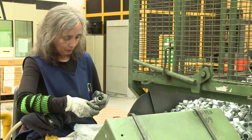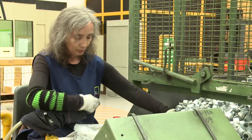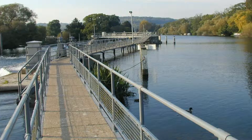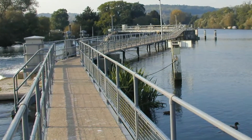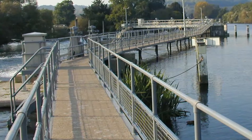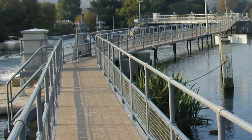This means that the average life of a structure using corrosion-resistant hot-dip galvanized Key Clamp fittings will be 37 years in a category three town such as Newcastle upon Tyne. This compares very favourably to the 4.7 year lifespan of a fabricated untreated steel structure.